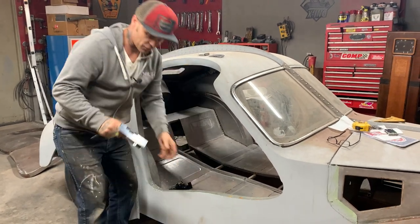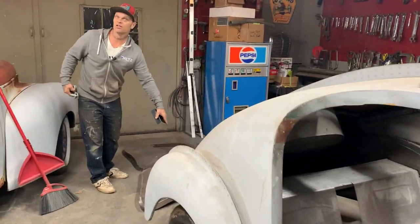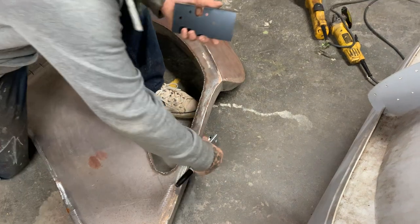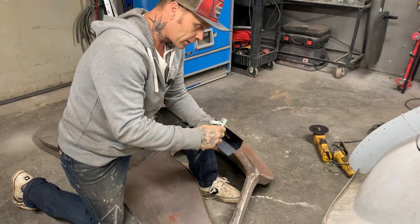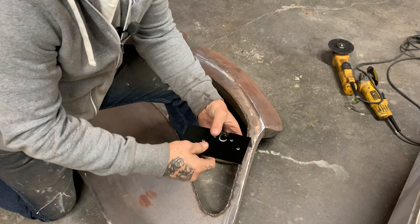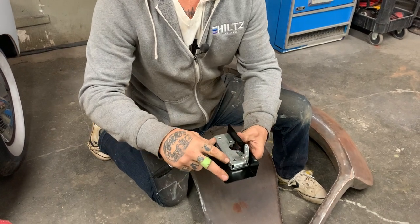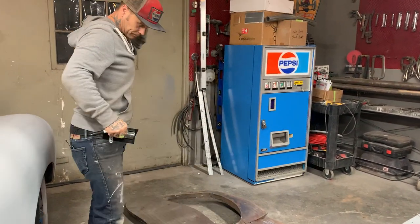The problem I have is Jolene's doors are only an inch and three-quarter wide. When I do these doors I'm going to have to put the lock up front, because we're going suicide so the lock's going to be in the back. I put that lock in there and it's almost just as wide as the door is. I'm going to have to pull this lock in further, drill new holes, and then I'll have it in as far as possible, cut this off, and that'll be welded on the inside of the door. Piece of piss.